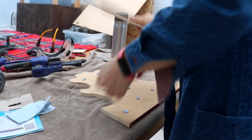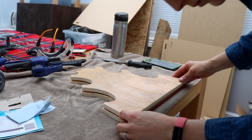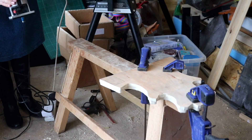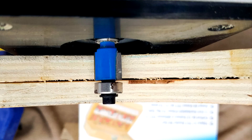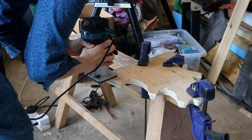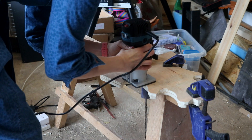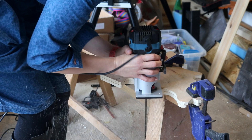For those that live outside of the UK, blue tack is a little bit like a firm chewing gum, which is usually used to put posters on the wall. Then I also clamped it together onto the saw horses. Here's a quick glance of the flush trim bit I used with a bearing at the bottom — the silver bearing runs along the good copy, then trims the excess off from the slightly larger one. I know router bits can be a bit of a minefield, so I'll leave an Amazon link below. Mine takes a quarter of an inch, you can buy half an inch ones too, and it comes as part of a set.